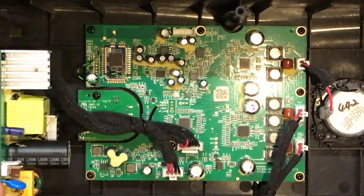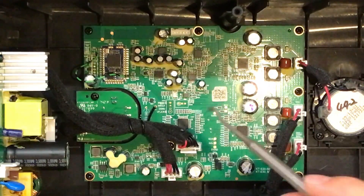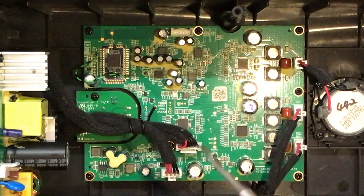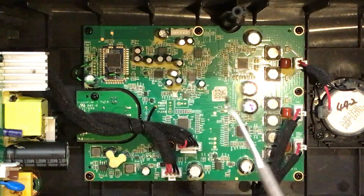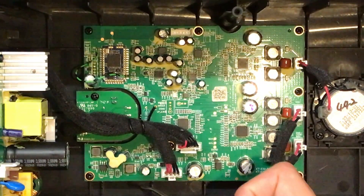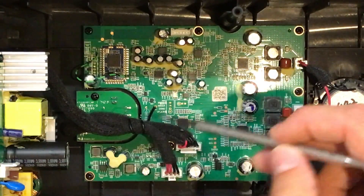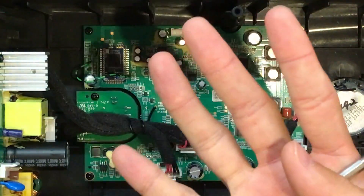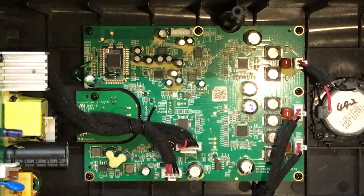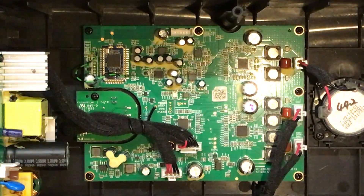With this mod we cut the trace to protect the Bluetooth chip and feed it 1.8 volts to fool the main chip into thinking music is always playing, so it will never turn off. Now that the speaker is finally usable, in the next video I'll show how to add a battery pack to make it mobile. We have an 18V supply, we'll take that to a current-limited buck converter, into a 3 or 4S pack with balancing and protection circuitry. Thanks for watching.